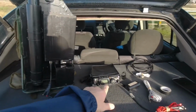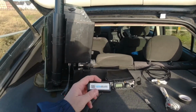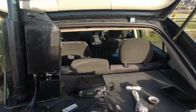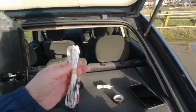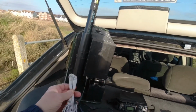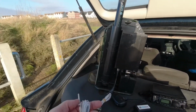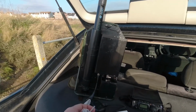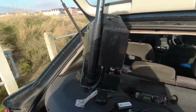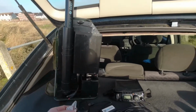And the radio I'm using is a Yaesu FT817. Standard microphone, but I'm using a SOTABEAMS inline speech compressor. And then I've just got a patch lead to go to the radio. And counterpoise wires. There's actually about 4 or 5 wires there, the longest one being about 16 foot, so quarter wave on 20 meters. I'm only going to operate on one band today, 20 meters. I have operated this before on different bands with an LDG 4-to-1 balun or impedance transformer in line, but I'm going to stick to 20.